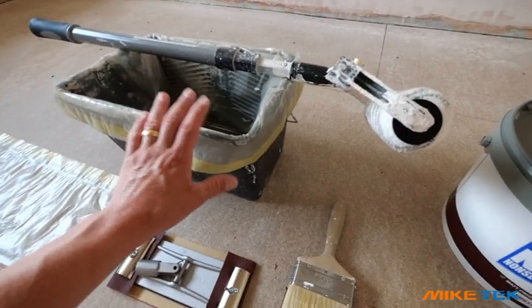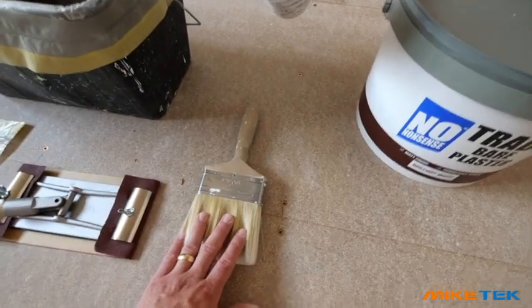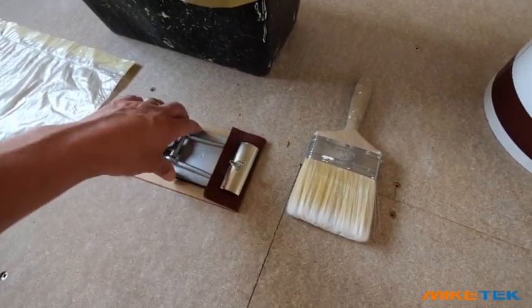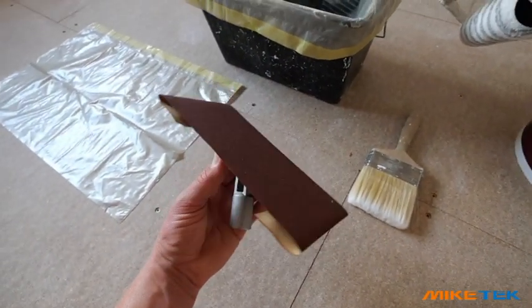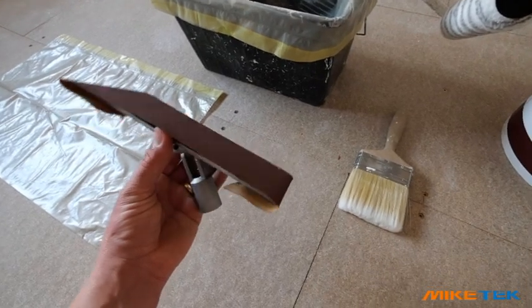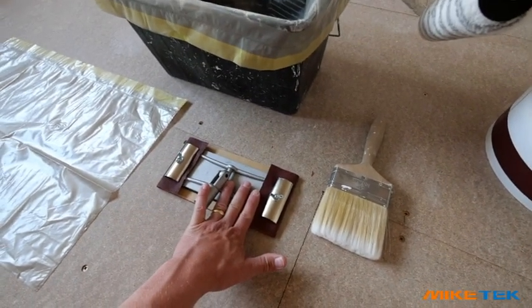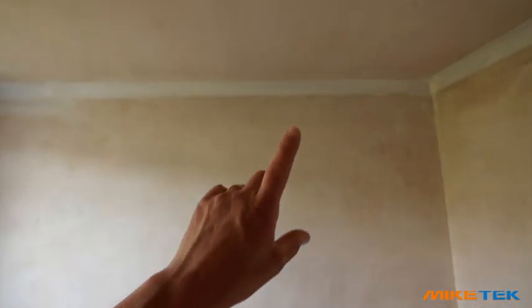With a paintbrush, I've gone for a four-inch brush to go around all the outside first. I've also got sandpaper — once you've done a base coat, give it a nice light sand over and that just gives you a super smooth finish. This is 120 grit. You haven't got to go mad on the grit, just enough to take off any roughness on the walls.